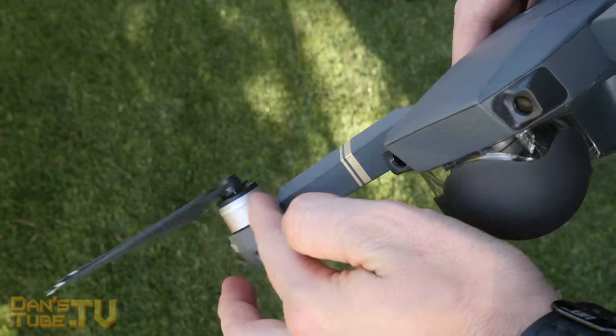With your pre-flight check, you need to check the motors. Make sure they are brushless motors — there shouldn't be any friction at all; they should spin freely. If you feel any friction or a loose ball bearing, do not take off, because that motor could fail at any point and the drone could drop from the sky. Make sure you maintain your motors and check them every time you take off and land.